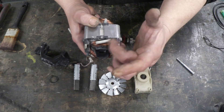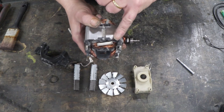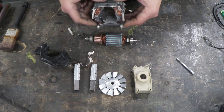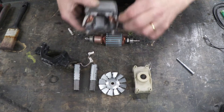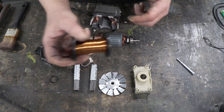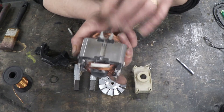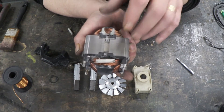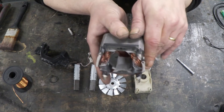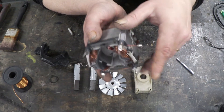You'll find the crimps at the top underneath a little bit of sleeve. To repair this coil, all I have to do is find the right gauge of wire and solder a little bit more wire in there. The gauge is easy — just put a micrometer across it, get the thickness, look up the gauge chart, and find wire with the right gauge. If you don't have a break, you can uncoil and remove all the wire and rewind the coil. For a cheap motor that wouldn't be worth the trouble, but these motors do run up to thousands of pounds, so if you've got a burnt-out coil it's worth repairing.